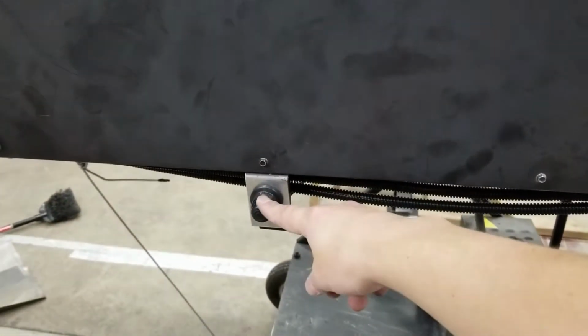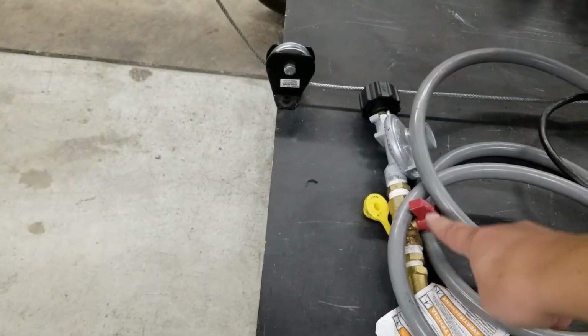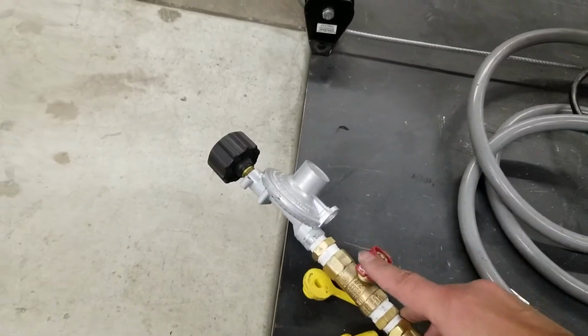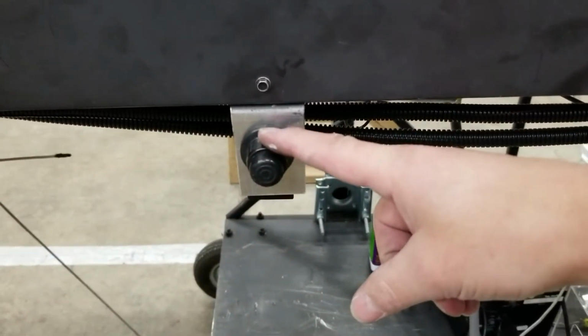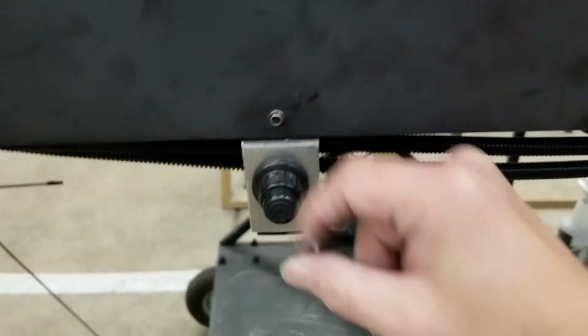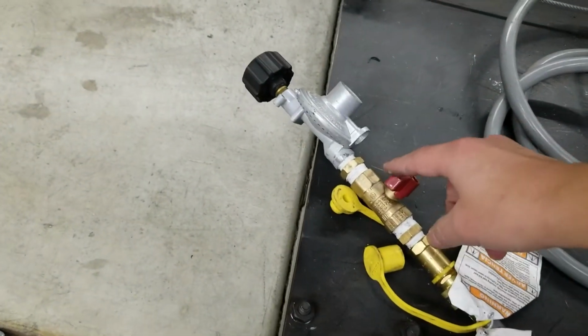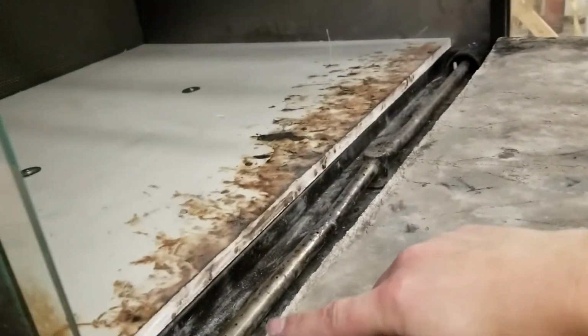The procedure for the ignition system consists of connecting this hose and regulator to a propane connection. You need to start pressing the ignition system. You will hear a small beep, click, click, click. While pressing this button, slowly open the propane source and then wait for the line source to ignite the excelsior material.